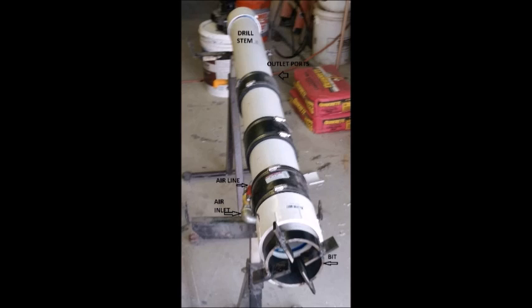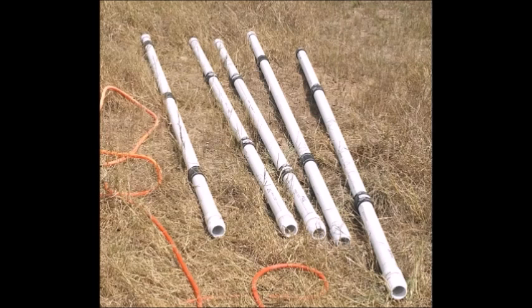The compressed air that is introduced mixes with the drilling fluid inside the drill, making the fluid inside the pipe lighter than the drilling fluid outside the pipe. Because the fluid in the pipe is lighter than the fluid outside, it is displaced and rises to the top of the borehole. This fluid then exits the pipe through the holes in the drill stem, seen here covered by black colored seals. Each black hole is located precisely in its required location — if even a single outlet is misplaced, the entire device may fail to work properly.